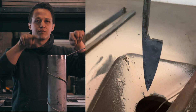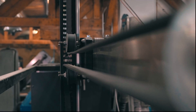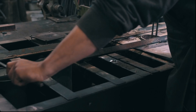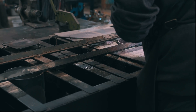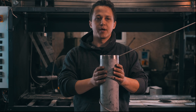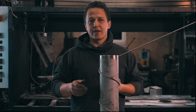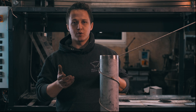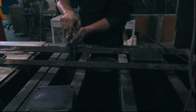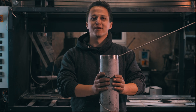You could use a funnel on top that will eliminate most of that. I need the top surface even so I can use a manipulator mechanically. But if you do this by hand, a funnel on top will be fine and you will eliminate most of these sand emissions. As this is not silica sand, you don't really need to be worried extensively about fine dust. Aluminum oxide is on the better side — it's very heavy and it doesn't tend to stay in the air for too long. Anytime you use a quenching oil, I would definitely recommend any kind of dust extraction, because you'll have oil fumes. So having something close by or a window open is always recommended.